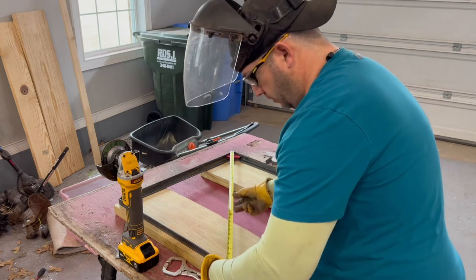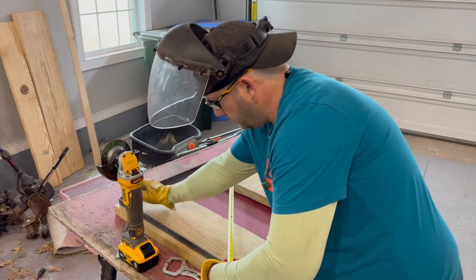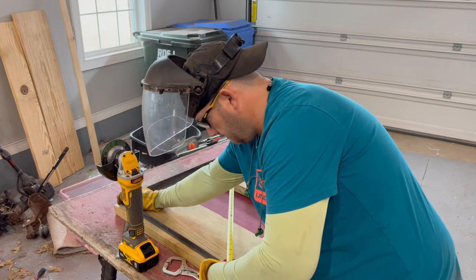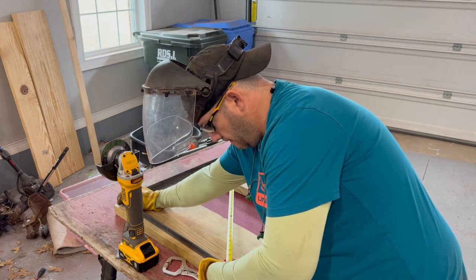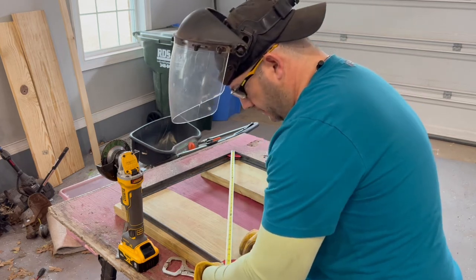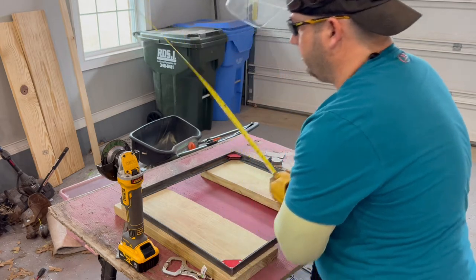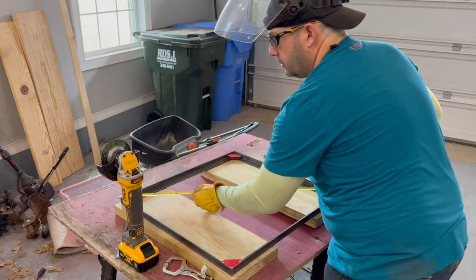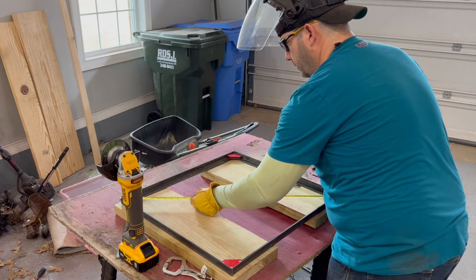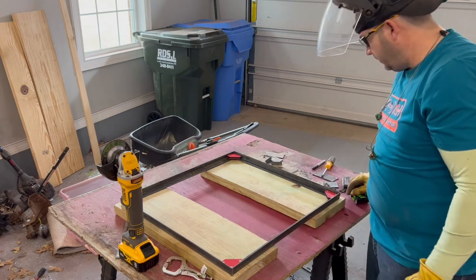And this is how you check to be sure you're square. Sure we're squared up. If you're not squared up, then your door is going to be what my grandpa used to call cattywampus. That might be a new word for some of you people. I don't know. So now we are exactly square. See, I did take a little bit of patience, but it's no biggie.